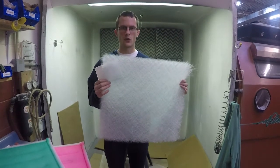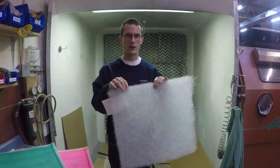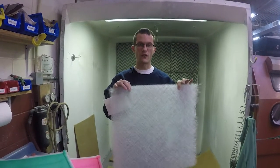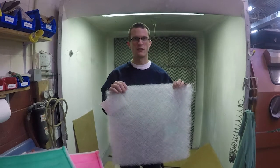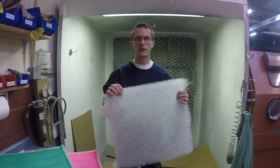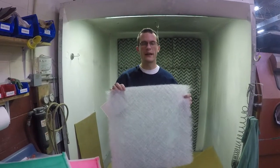They could be well used in a 2-stage system where you're going to use a pocket filter behind this filter. A 2-stage system enables you to use a cheaper sacrificial first layer, and then the back layer, the pocket itself, protects the fan and ultimately catches any residual overspray. That can be a way to also save money, by going with a pocket style filter in the back with a filter or blanket in the front.